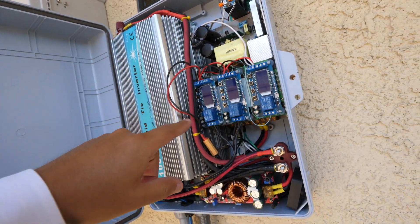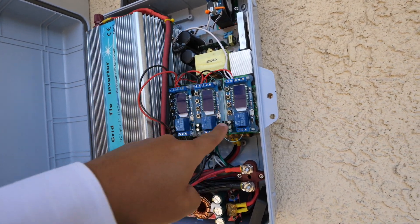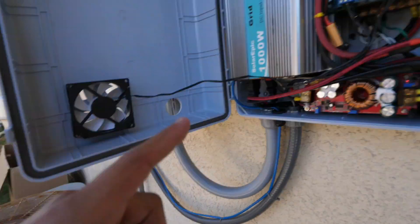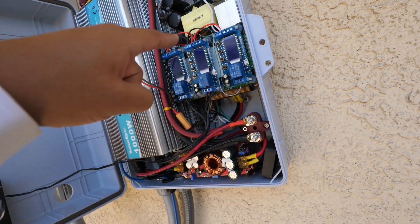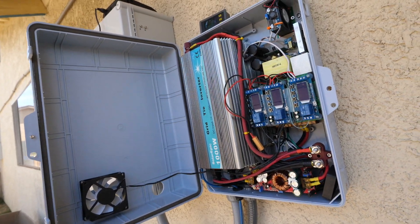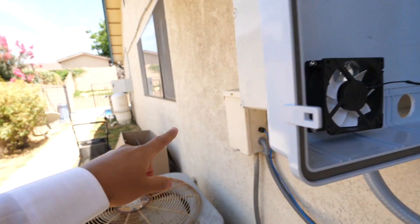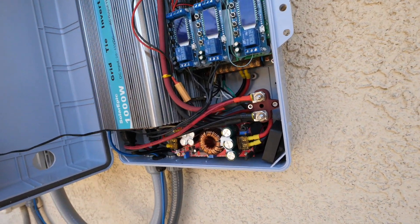They will keep doing that until the battery runs out, or until this timer reaches six hours. At that point it will switch off, preventing the AC cycling from having any effect. That will let the charger charge the battery fully, and it'll wait there fully charged until the next day at noon when it flips back into connecting everything and the cycle begins all over again.